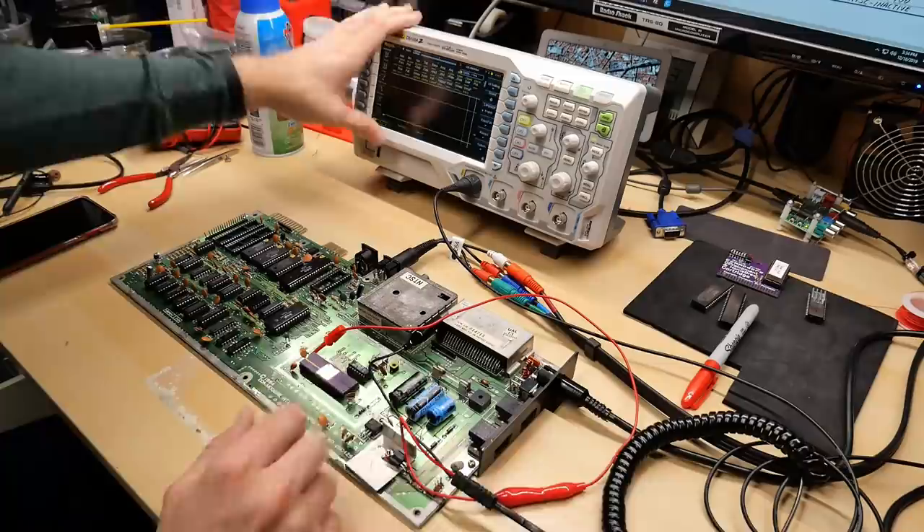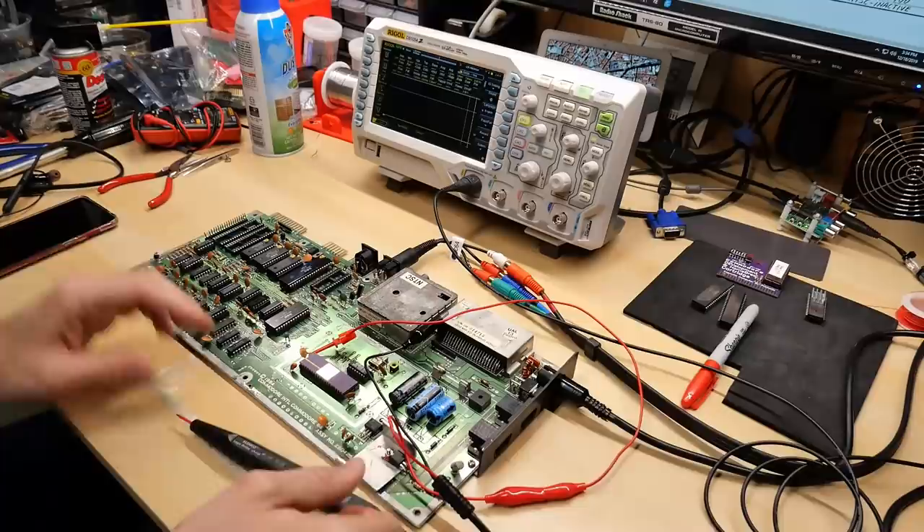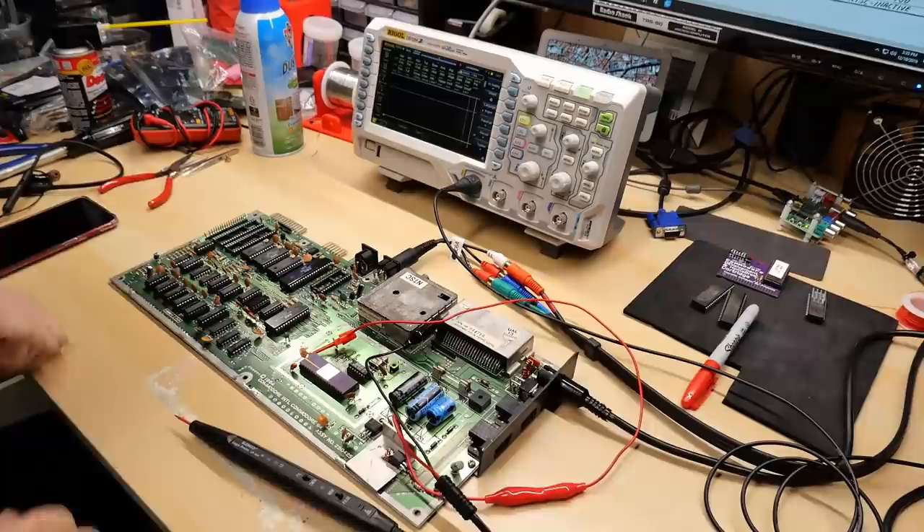A lot of these solder joints on the reworked chips look really crappy. I'm going to reflow them, which will hopefully fix the bad RAM chip power lines and any other intermittent connections. Reflowing the solder on that one bad RAM socket did fix the ground and 5 volts to it. Unfortunately, powering up with the dead test still results in a plain black screen, so there's definitely more wrong with this computer. I have my oscilloscope on the bench, my logic probe, power connected to the C64, and the schematics up on screen to help me.